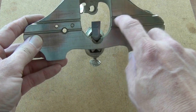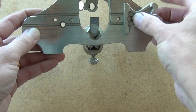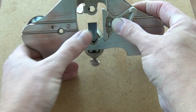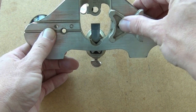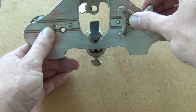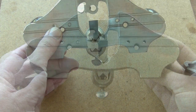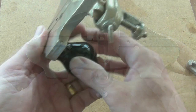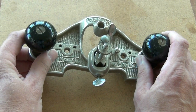On the sole you'll see a couple of milled tracks — that takes this fence, so you can set the shaving a certain distance from the edge of your work. There's a straight fence for use against straight-sided pieces, and there's a two-point fence for curved work. It's also very easy to make your own fences out of hardwood, either tracked or not, and you can screw them through the various holes in the base. It's very easy to add sub-bases for additional support, and it's also possible to create a sub-base which is angled, allowing you to take an angled cut.